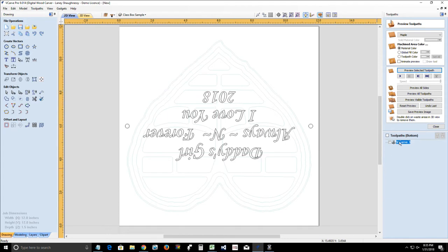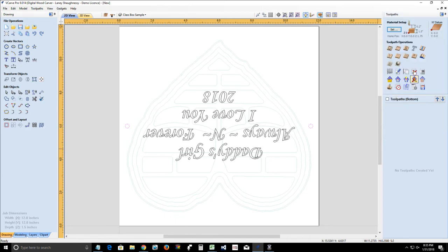Let's create our two toolpaths for this. I'm going to go ahead and delete that one because I went through that one kind of fast. We will start off with our alignment holes. Drill our alignment holes first. Now, with the alignment holes, you can do a drilling operation since we're using the same size diameter bit, a quarter inch end mill, to create the holes. If you were using a smaller diameter bit, you would want to use the pocket toolpath so it comes in here and pockets that out to that quarter of an inch. I'm going to use the drilling operation